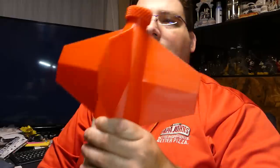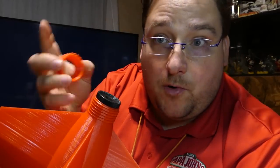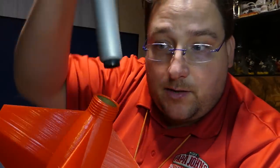Regular PLA will also anneal. And the trick is keeping it straight, keeping it from warping. I don't think these will warp because they have geometric structure. So I think these will be okay. My concern is the tolerances of this hole. This is over-toleranced, but the section down here that the tube actually inserts into is well-toleranced. The tube actually is a nice friction fit. You can see this thing is holding itself together, and there's no glue. I haven't glued it. You can't fly it like that. You got to glue it. But the tolerances are nice enough that it's holding itself together like that. And then you also have to have sufficient tolerances to be able to thread this on and hold the motor in place. And also, this needs to be able to slide through this open end and fit in place.